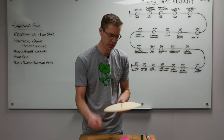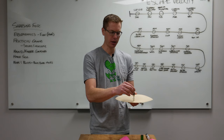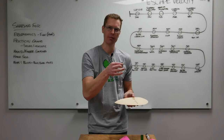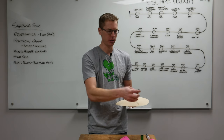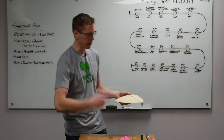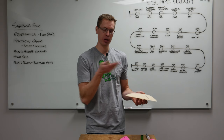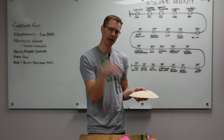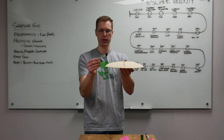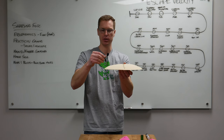I'm dropping this in and putting my set screw hole in there. One thing to note: you could go straight down, but because this is curving down, you're going to have to drill in a lot farther for that screw head to recess. So I did it at a slight angle. If you push that angle too much — like at a 45 — what might happen is the screw tries to walk up the wall and not drive into the plywood. It's really important you don't run a steep angle — you want close to 90 or you'll have to go very deep for it to recess nicely.